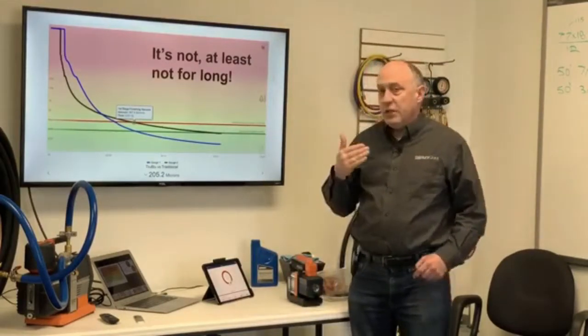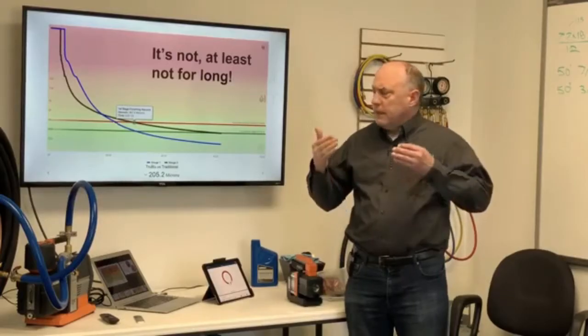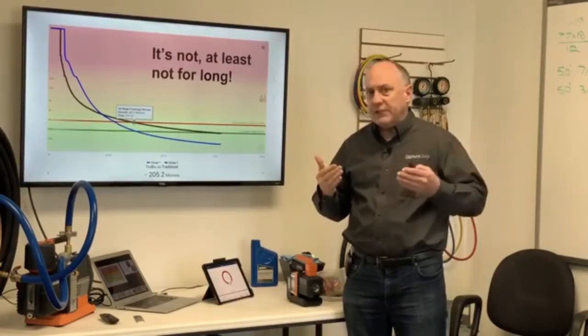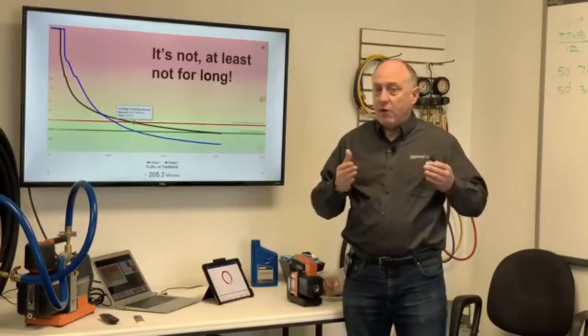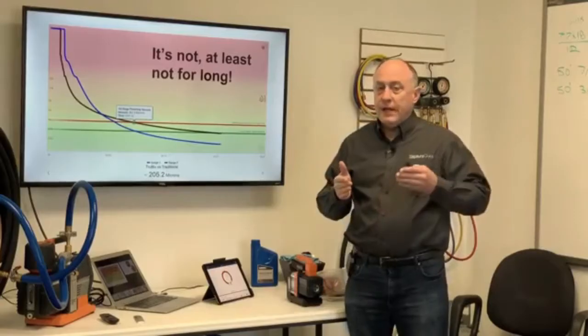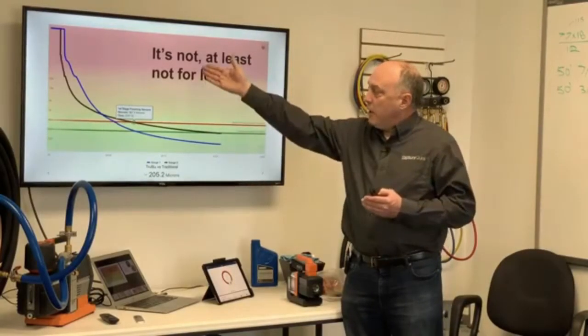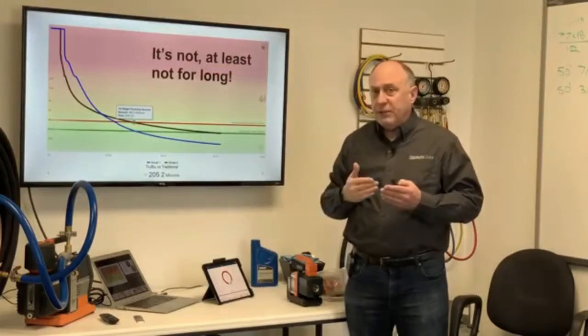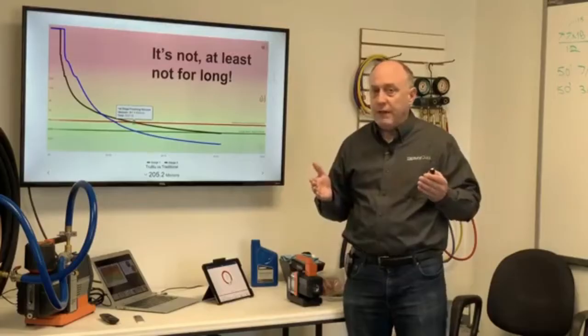Well, initially when we have the 1/4 inch hoses, what we're seeing is that we're able to pull down much, much faster because the hose is not the limiting factor, right? We have all this pressure in that tank, and that pressure can push through the 1/4 inch hose, and the hose can move more than 2 CFM of flow. On the smaller pump, the pump now is the limiting factor. So even though we're tied to the larger hoses, the pump can only move 2 CFM.